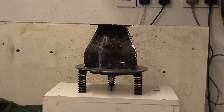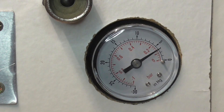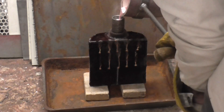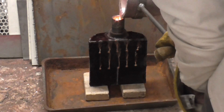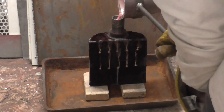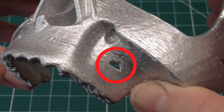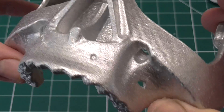Either the flasks warped due to the heat and wouldn't seal on the vacuum plate, or the pump just couldn't draw enough vacuum. The largest parts I just cast in the flask without vacuum. I did have a few failures, but none so bad that I can't fix them with a little welding.